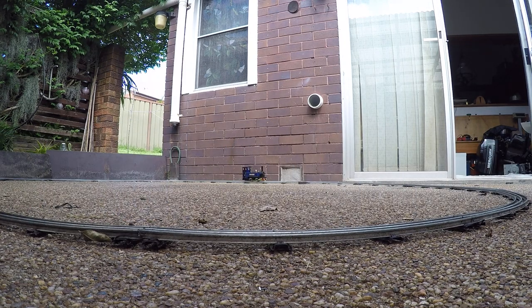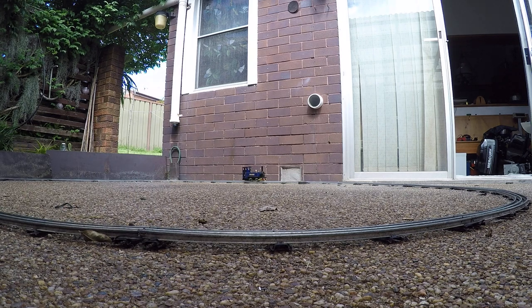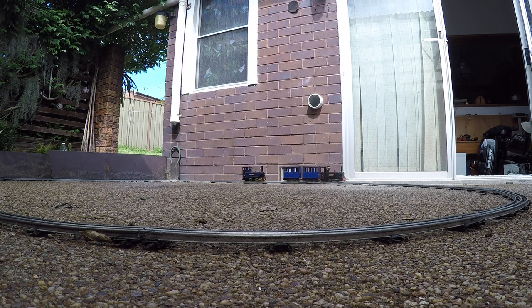It doesn't need it — nothing's marking. It's really shiny, that's beautiful. Ball bearings — the wheels got reflanged to suit this track, I cut the wheels about a millimeter. Ball bearings and lubricated, it works. The ones that sit up on top don't work. I'd mount one in the cab — if I was buying one I'd get the cab-mounted one, but the line that runs all the way forward, at least you know you're getting oil. That front-mounted one is just garbage.